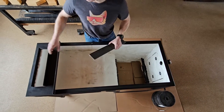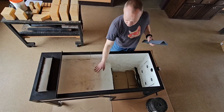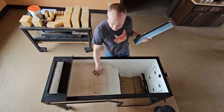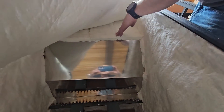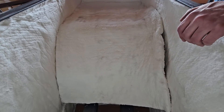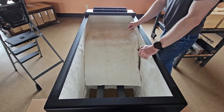We have a couple pieces of insulation here — one piece on the very back of the arch before we put our final piece in. We're running a hybrid drop flue evaporator, so we had room for one extra layer of insulation here, one extra layer under this belly piece. Just a note: we're using this arch with a hybrid pan, so we have enough space to add this extra layer of insulation, which will help push the heat up into the flues. If you have a high output drop flue pan set, do not add any extra insulation. Your flues are deeper and require more space.